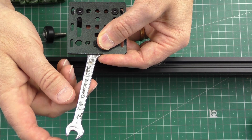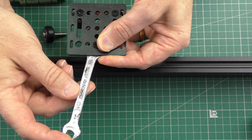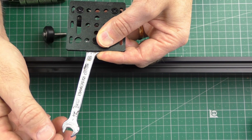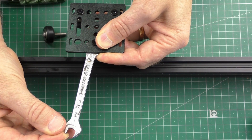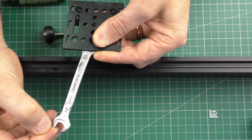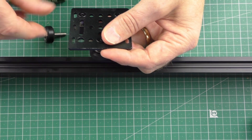You can see my spanner — I'm going to adjust the nut as if this was on my printer. Did you see it? I actually moved that spanner and I hardly moved it at all. I'm going to adjust it again — that was too much, I'm going to move it back. It's just gentle. If you're doing this much, that's too much. You want to do little bits at a time to prevent flat wheels.